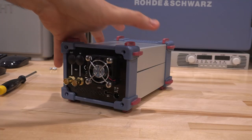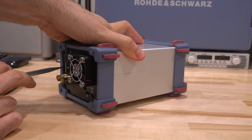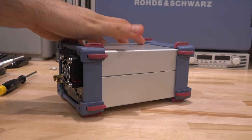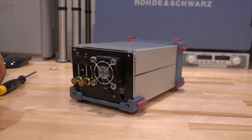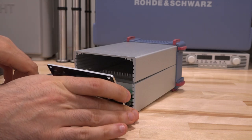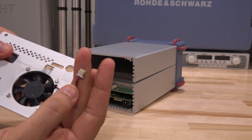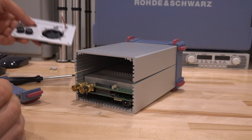Taking this apart is pretty straightforward, but I did notice something. If you look here, the metal in front of the chassis is tucked behind the blue spacers but in the front it's sticking out, which means this has already been opened — and that worries me because the description said it was never opened and repair was not attempted. Also, the fan connector is totally broken off, so that's the first problem.